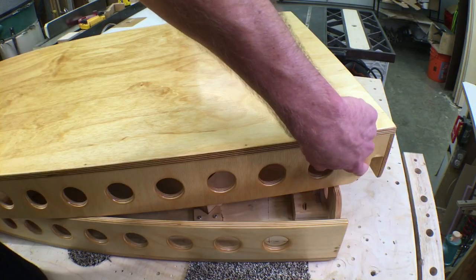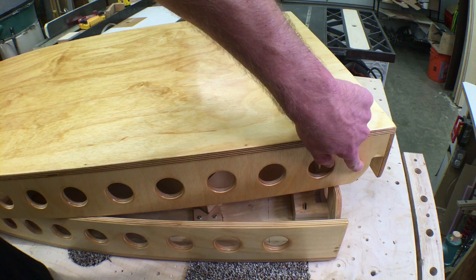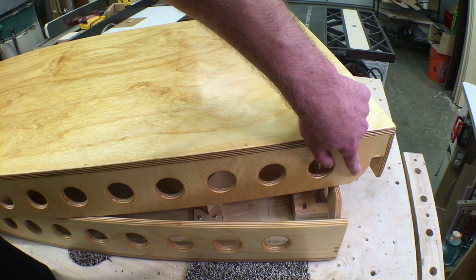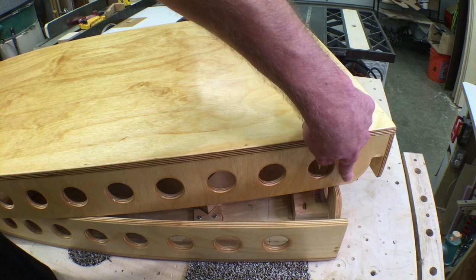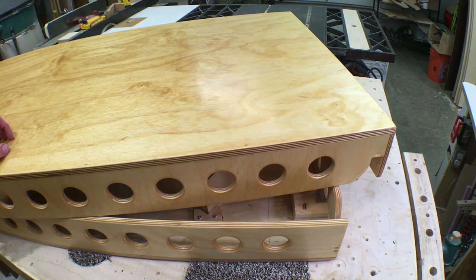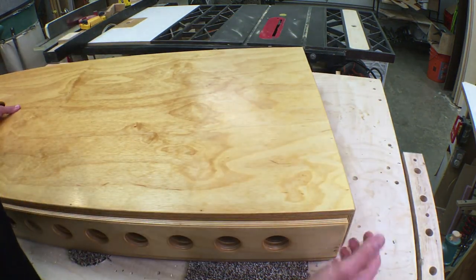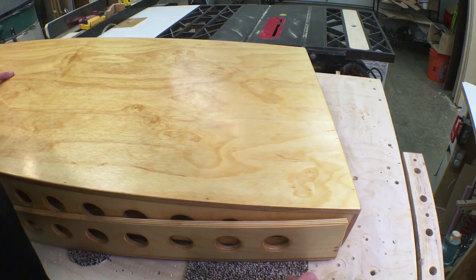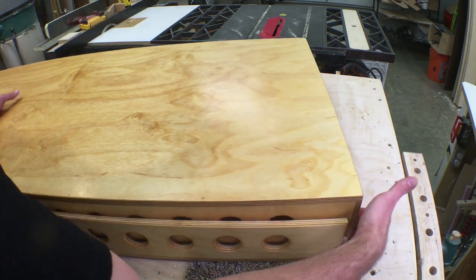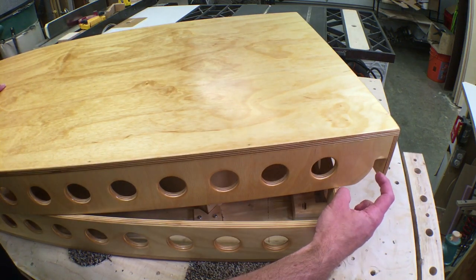You can avoid this problem if you just pick up the whole thing at once, but cut a 45-degree angle here. If I was to do it again, I would bring it back to this line here where there's just a little bit of a ridge, then straight to the 45. That'll nearly completely eliminate that risk by making sure there's clearance in that 45, so that when just one side of the board is pulled up, there's nothing there to grab.